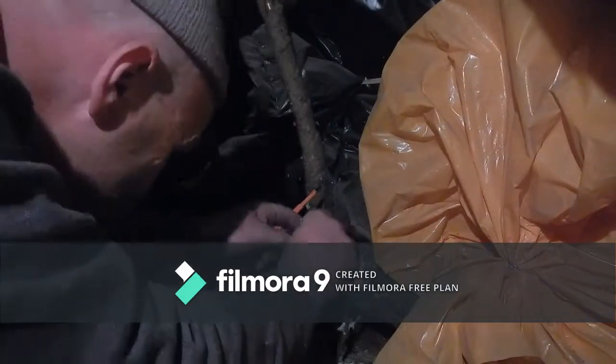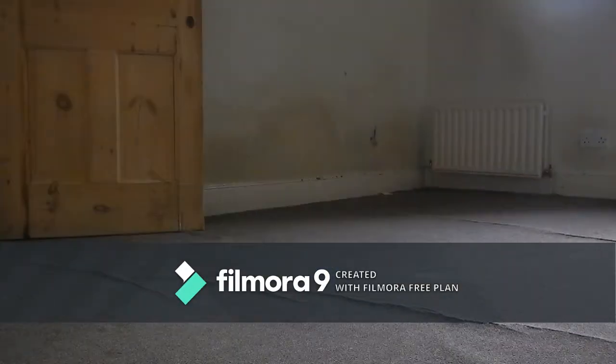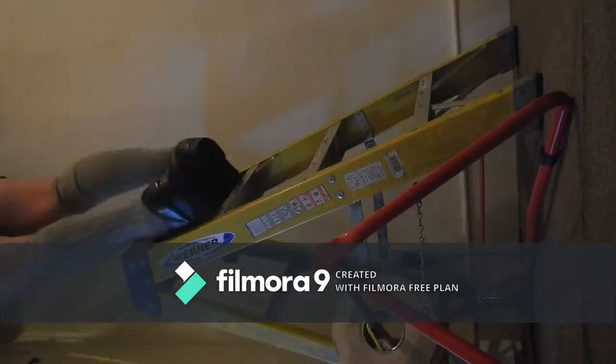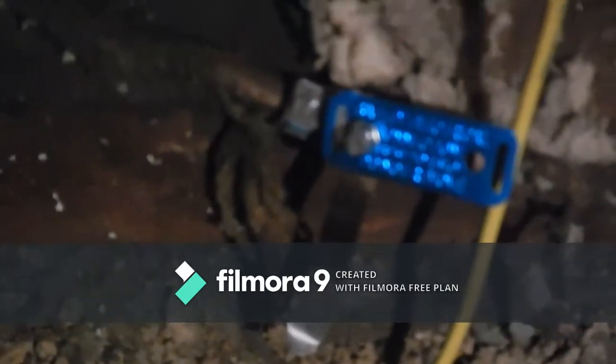Let's get started. I'm running 10mm bond cable most of the way through – all the way through in fact – and it comes round ready to join to the BS951 clamp.